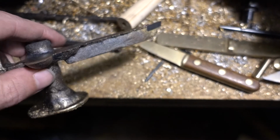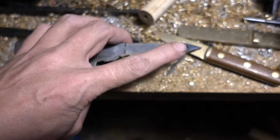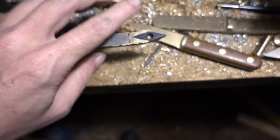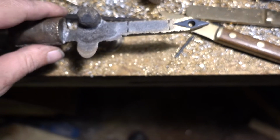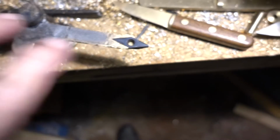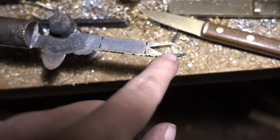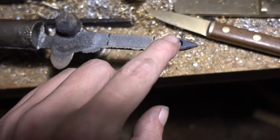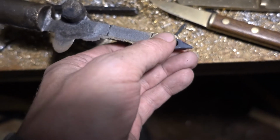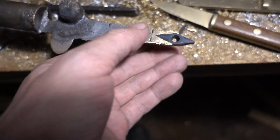Also the design of that tool holder is just crude. It's just like a high-speed tool or whatever, and you can make it a little more rigid at the top, at the tip, but just going straight down. I mean, you have the relief of the carbide. So yes, you can make your custom tool holders for flea market find carbides. Of course I have to drill a hole and tap it and get some fitting screw, but other than that should work fine. I mean, it's not wiggling or whatever. It's solidified around that carbide, so it's a perfect seat.